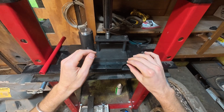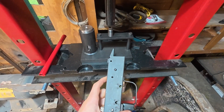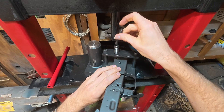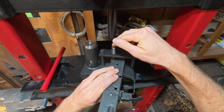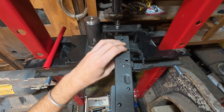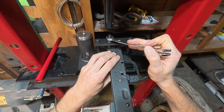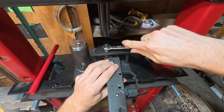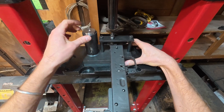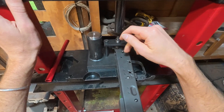I've got these down tight. Now I have this dimpling tool we're going to use. We're going to put the receiver in here, slide this dimpling tool down through here, and you've got to make sure to put in this spacer to hold everything in place. This specific size is half inch for my specific build. You want this pretty tight. Let's get this lined up and centered — we're just going to press this down and dimple out this hole, and we're also going to dimple this hole too because we've only got two rivets on this side.